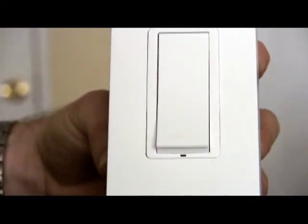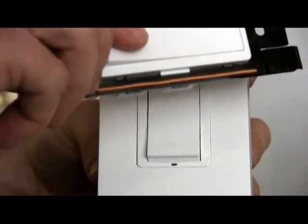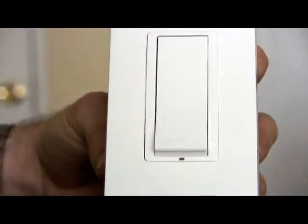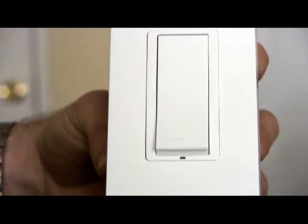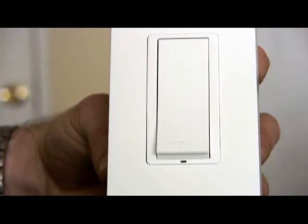The red LED means that no devices have yet been learned. Now press the remote switch and watch the LED turn amber to confirm that the device has been programmed. The LED will then begin to blink green, which means the remote has been learned to the receiver and we are now done programming.